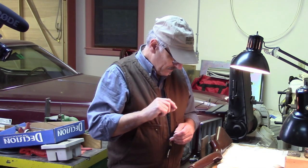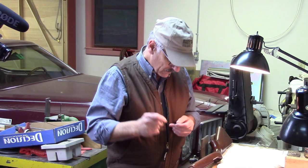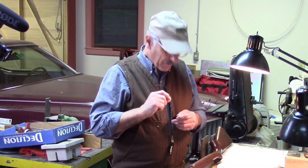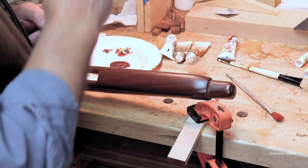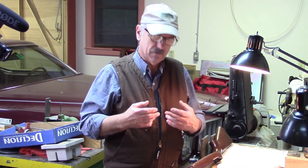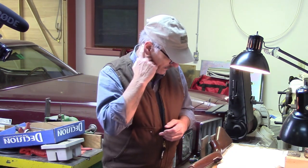Yesterday we painted out that epoxy line with a gray slash tan color — the opposite of dark is light — and the epoxy line itself has disappeared. With that crack or line essentially gone, I can now begin to paint over it and paint in the grain coloring itself, which is the faux work. Let's go ahead and do that.